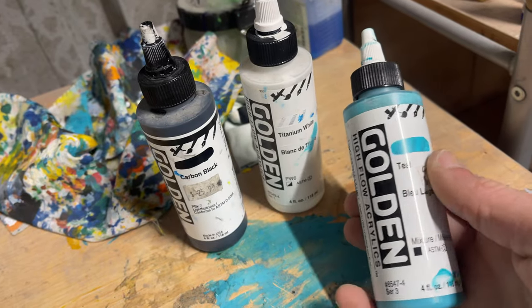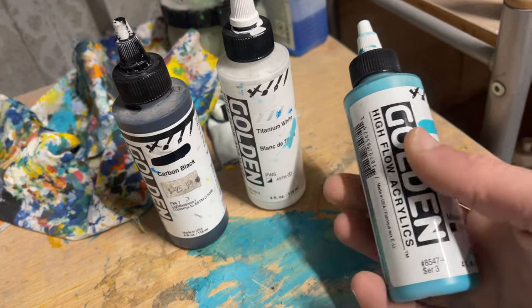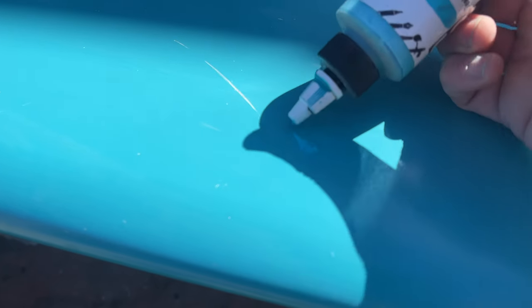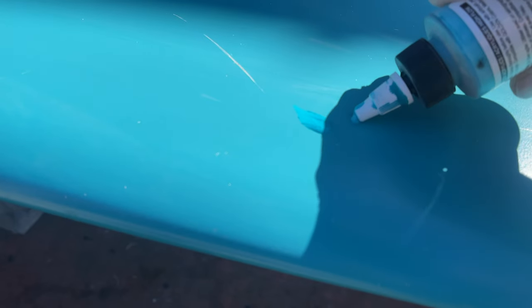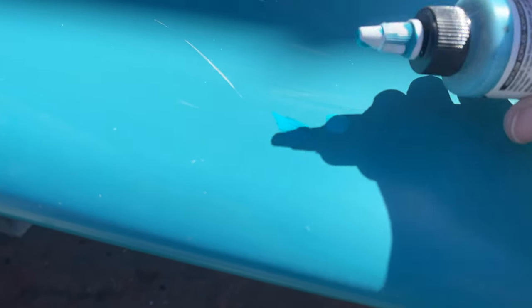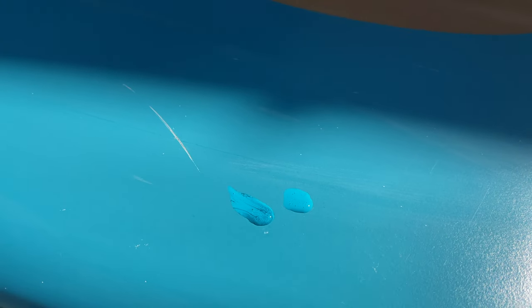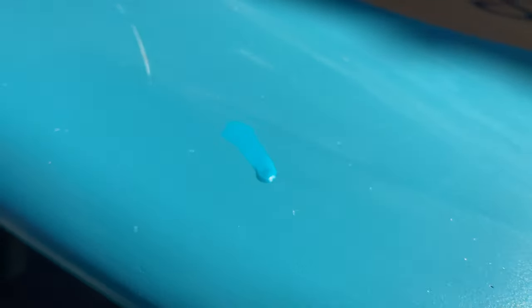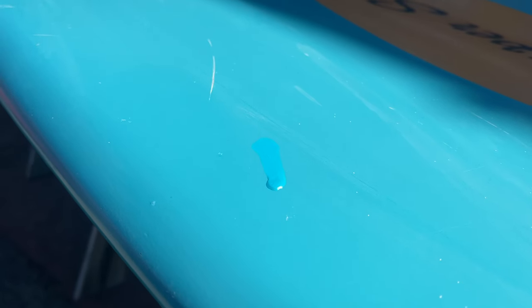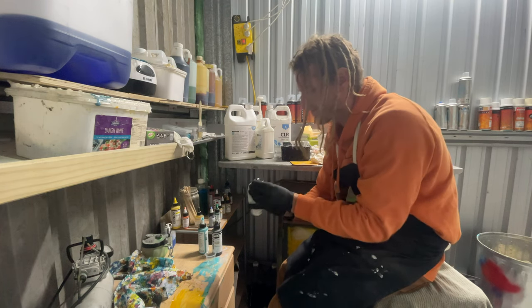So we're going to start with our closest colour which is this golden high flow teal. I'm going to put a dollop of this on the board and see how close this colour is to where we want to get to. You want to move your board or whatever it is you're colour matching into natural light, ideally direct sunlight — it's going to be a lot more reliable and true than the lights in your workshop or shed. So our colour straight out of the bottle is far too lively and white. It's really bright, really vibrant, so we need to grey it up a little bit and dull it off. The paint is still wet which is going to make a big difference, but I can tell straight off the bat even when it's wet that it's just not right.